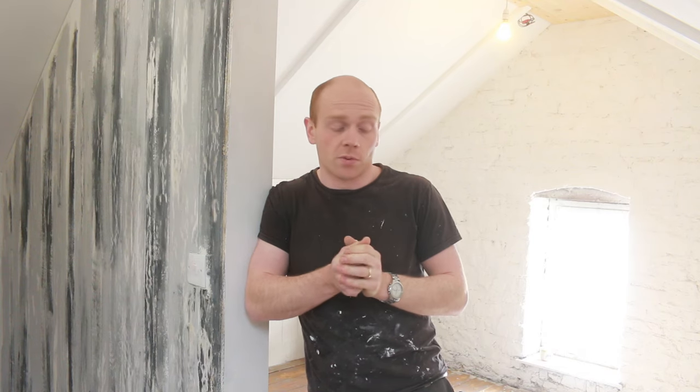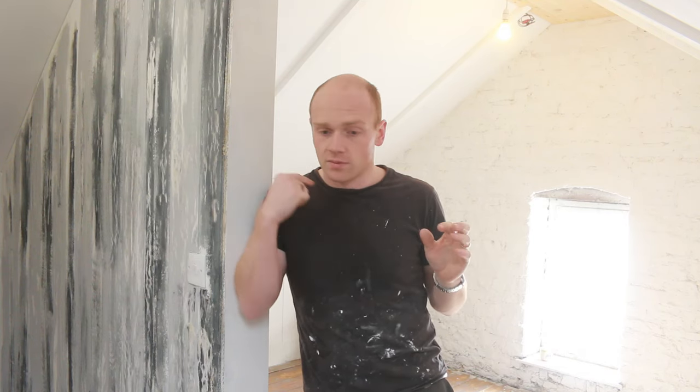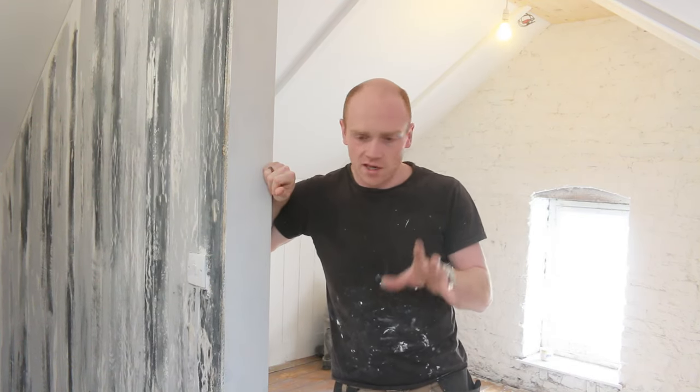In the office I need lots of sockets, which I'm just going to go surface-mounted under the desk, fixed to the panelling. If I started chasing into the wall and fitting socket boxes and this becomes a bedroom in the future, we'd end up with six double sockets in a row. Surface-mounted sockets might not look great but they're much easier to take off and fill holes. I just wanted to keep it future-proof. It's literally just one ring to go through and bring sockets through, and we can bring more through from the outside as and when we want.